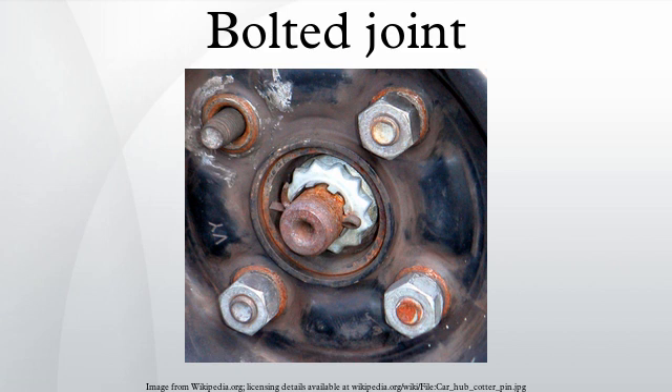When a value of μ equals 0.15 is used with the dimensions for any size bolt whether coarse or fine, the nut factor is K approximately 0.20, and the torque-preload relationship simplifies accordingly. A study of the effect of torquing two samples — one lubricated and the other unlubricated — of one-half inch 20 UNF bolts to 800 lb·in produced the same mean preload of 7700 pound-force. The preloads for the unlubricated bolt sample had a standard deviation from the mean of 1100 pound-force, whereas the lubricated sample had a standard deviation of 680 pound-force. Solving for the nut factor gives K equals 0.208, very close to the recommended value of 0.20. The preferred bolt preload for structural applications should be at least 75% of the fastener's proof load for higher-strength fasteners, and as high as 90% of the proof load for permanent fasteners.